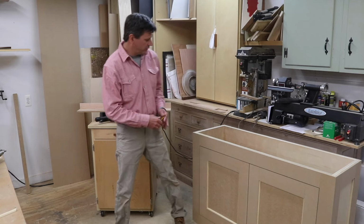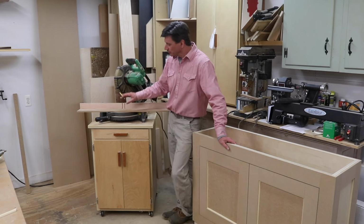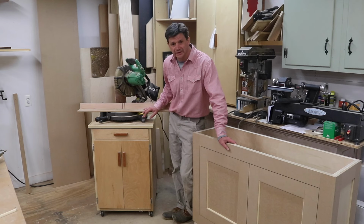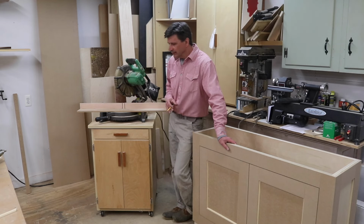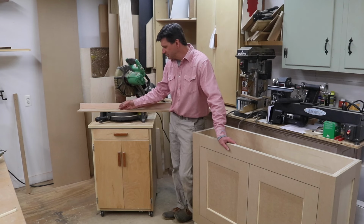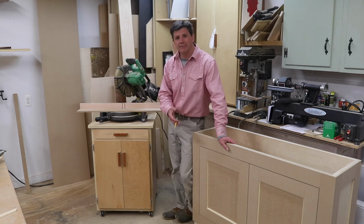And you probably noticed that I've got a little bit of a different fence on my miter saw here. This is called a sacrificial fence, and you can make one of these, and I'll have a link in the description to the one that I made. And this just makes making tight miters really easy because you can line that pencil line up with the kerf in your fence.